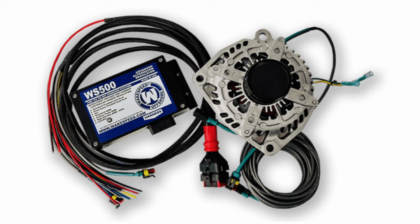The flip side to a larger battery bank is how you recharge it. If you want to run an air conditioner, you might get through the night but then your batteries are depleted. You need a secondary charging system — through the alternator, through the V-Inverter as in the Omnia van, or with a second dedicated alternator for faster charging, which is really the option you'd have to consider with a very large battery bank.